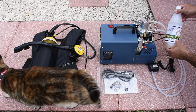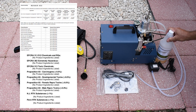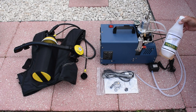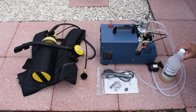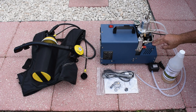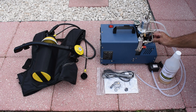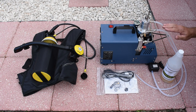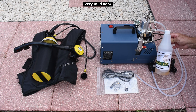This one is Nuvaire 455 premium food-grade breathing air compressor fluid. A quart is not cheap — you're looking at about $32 a quart, and with shipping you're paying another $15 to $20, so anywhere between $40 and $50 for a quart. The good news is you can fill the compressor three times with it and it's designed to last a long time. The flush procedure: drain the oil, refill to the dot, turn it on and let it run for about 15 to 20 minutes, then drain it again and dispose of the oil properly — absorb it in cat litter before throwing it in the trash. The third time, fill it back up and you're good to go. When you smell this oil it has virtually no odor compared to the other one which was very strong.